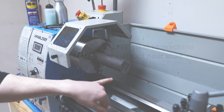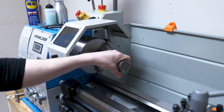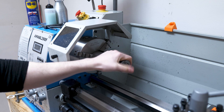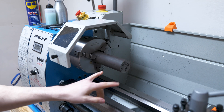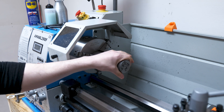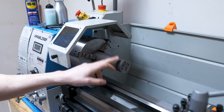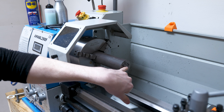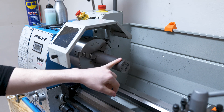This is a piece of EN24T. Unfortunately the smallest diameter I could find as an offcut is about 51 millimetres, so I've got a lot of stock to remove. It only needs to be about 30 millimetres sleeve depth. We'll bore the hole and then take this down to the outside diameter — 20 millimetres inside the bore and 26 millimetres for the outer.